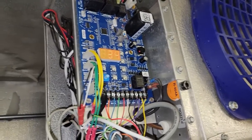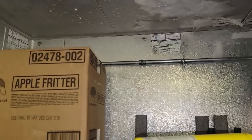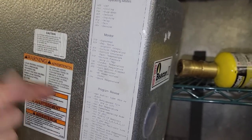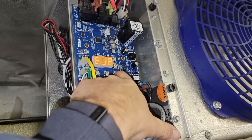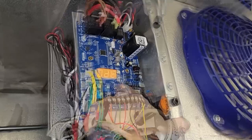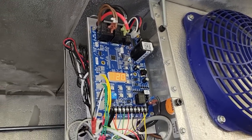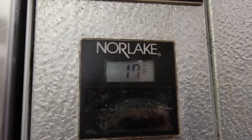It's going to be 34 degrees but we're only at 21 degrees in the box, so superheat is going to read high at this box temperature. Suction pressure SCP is kind of low, which looking at the refrigeration system upstairs doesn't surprise me. Putting it back to cool freeze, box temperature is reading 17. We're going to go ahead and wrap this thing up.